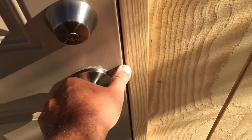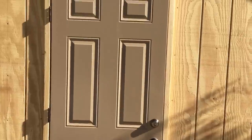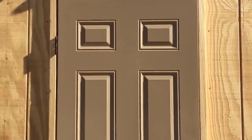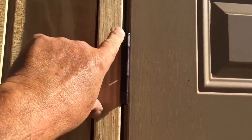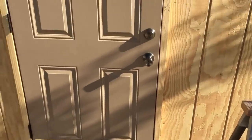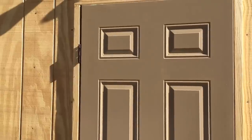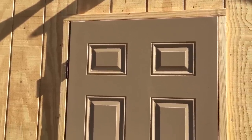I got it mounted but there's a problem — it's just a little too snug. It works, but it's a little too tight. I'm going to have to recess these hinges into the frame. See how big the gap is here — about a quarter inch on one side and maybe an eighth of an inch, if that, on the other. All it will take is a little bit of swelling and this door will get stuck. I wish I had a router hinge jig, but I don't, so I have to do it by hand with a hammer and chisel.